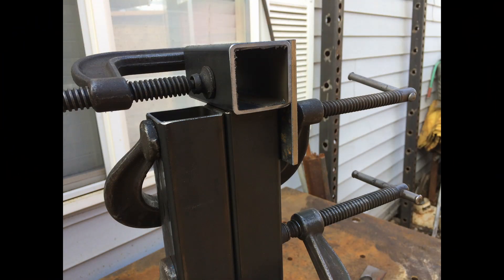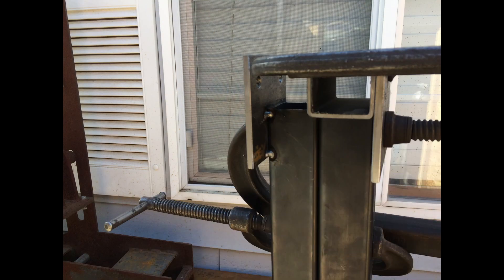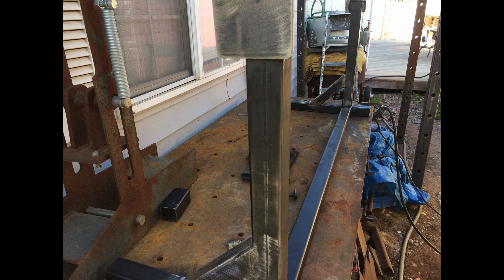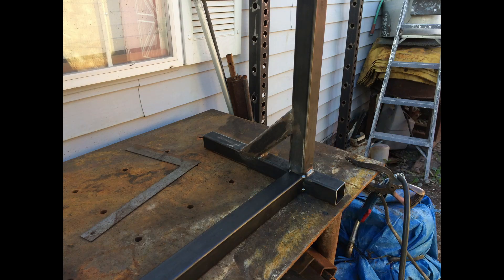The plates get welded to the uprights on the top. This two-inch square tubing is just there as a reference to mount that plate with two inches extending above the top of the tubes — clamped in place so I just have to set edge distance and they sit on top. Here shows them jigged up and ready to be welded. We've tacked the first plate in place, then put the spreader in position. All I'm doing at this point is making sure everything's square and tack welding it in place. I'm not going to permanently weld that until we set the bed assembly in and bolt it up, so I know everything fits and we can double-check our square on the cross tube and make sure it sits level on the floor.